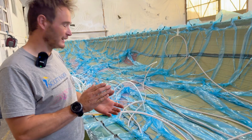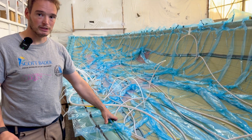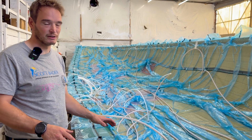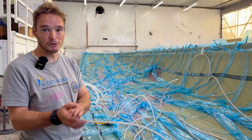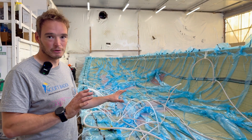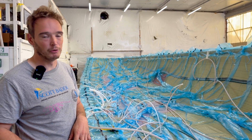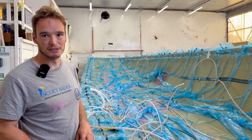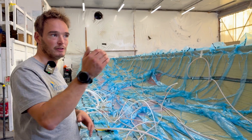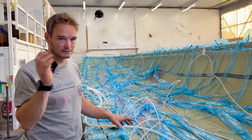After that, we skinned it, and we use Scott Bader's 690VE resin for skinning. As we said on the tooling, it's just a really good low-shrinkage resin, so you end up with a really nice part. You get very little print-through and it controls the process a lot more. It's also much better at bonding to the VE 67903 that we used for the infusion, which Dan's going to talk about in a minute.